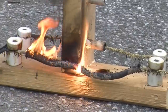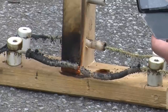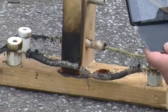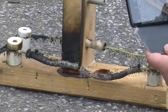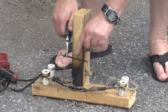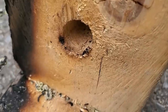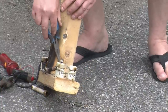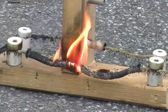The current just stopped. We're getting arcing right in the midst of the loom — not completely surprising, given that's where the temperature probably would have been hottest, and maybe also in the 2x4 near the tube. But I think that's our experiment. The insulation is really charred. Pulling out the knob to see what the wood looks like, there seems to be a little bit of charring right at the edges, but the inside is not charred.